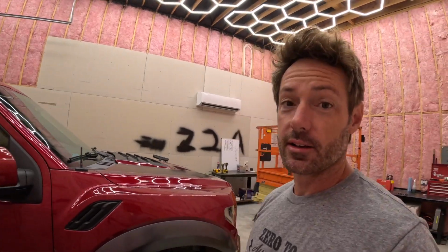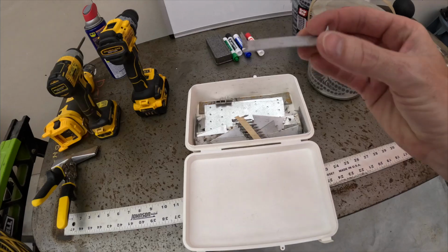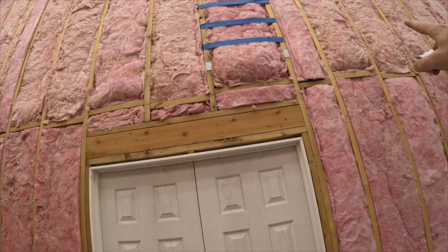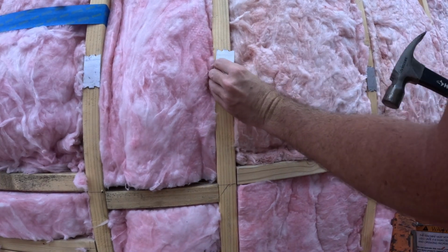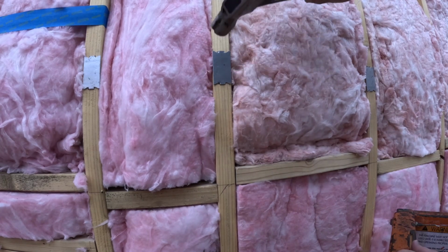So I'm gonna clean up real quick, get the truck out of here, and then we'll start getting to work. And before they get here, I'm also gonna try and put up the rest of these real quick. So these are nail guards. The way they work is wherever you have, like, up there, that's where our water line is running. So you put them on the 2x4 stud, so your line is passing through the stud, right? And you don't want to screw into it. So you put those there so you can't accidentally put a screw into your pipe or your wires, you know?